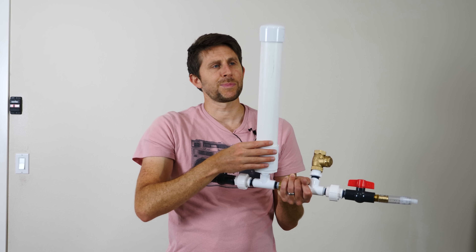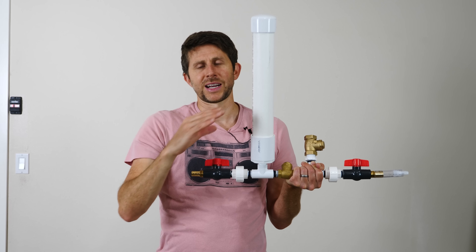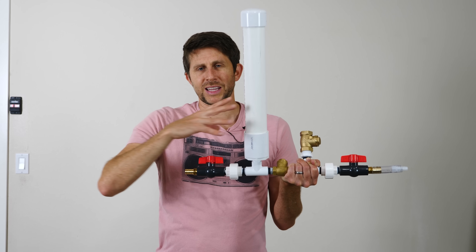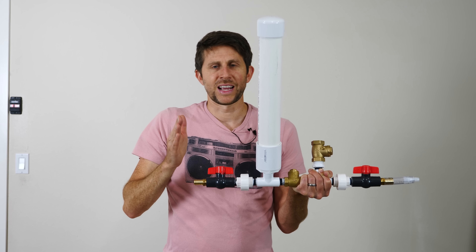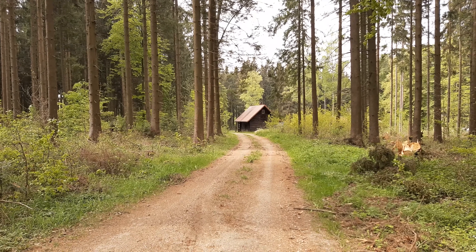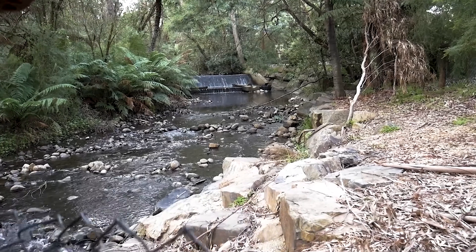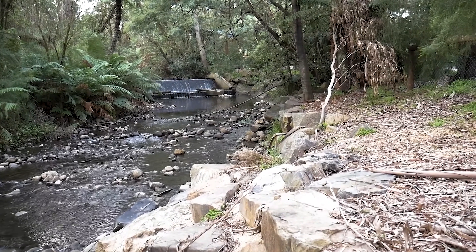This empty PVC pipe has air in it. Because the air can be compressed in there, it's kind of like a spring for the movement of the water. You want this to be filled with air to allow some springing motion so the water doesn't just slam and have too high of a pressure spike. These are great pumps for off-grid settings where you don't have any source of power, and you can put it in a stream or waterfall to pump water to a higher level than the source. And because there are no moving parts besides those two check valves, they can last a really long time.